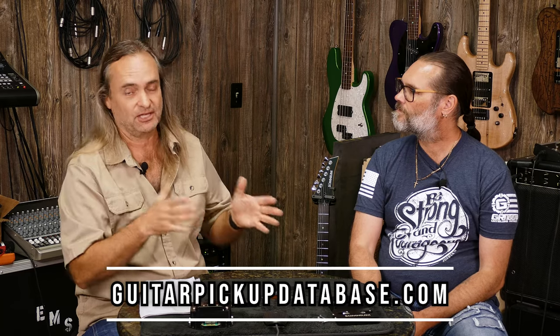There's a new guy I've met — his name is John — and he's putting together a website called Guitar Pickups Database, GuitarPickupDatabase.com. We'll have a link below. When you see specs on manufacturers' websites — Seymour Duncan, DiMarzio, EMG — they're going to list the type of magnet. Like these are ceramic magnets; might be an Alnico magnet, and that makes a difference to the tone. They often list the wire resistance too, because when you put a meter on this, that's more turns of wire. Depending on the wire gauge you'll get a different resistance, which sometimes translates into a tone difference — but sometimes not. We've done demos here of Dean pickups where two pickups had the exact same resistance but a very different tone.